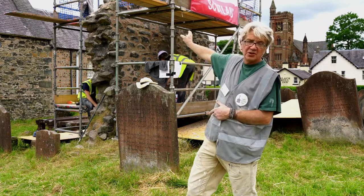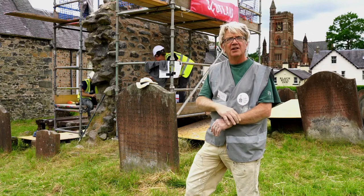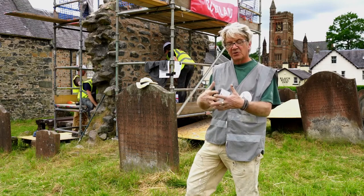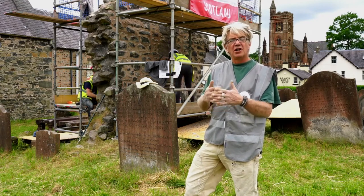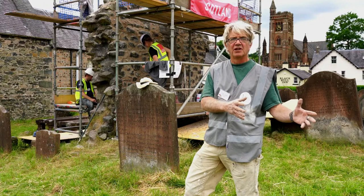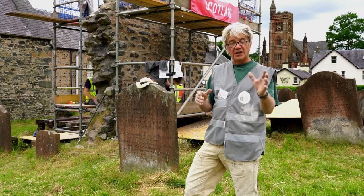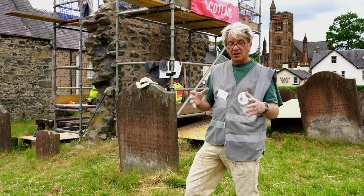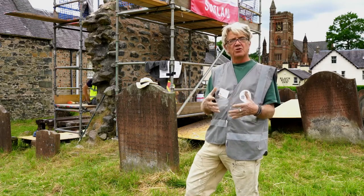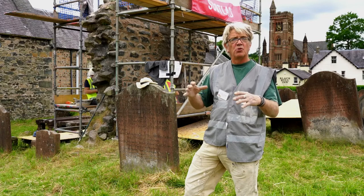So on the top, you can see, if you look carefully, at the moment the top mortars are looking very red, and that's because we've put a pozzolanic brick aggregate in there, brick dust I should say, to react with the lime and to create a hydraulic lime. But a hydraulic lime that I would argue is very different in its nature and character than a natural hydraulic lime. And again, you can make very pozzolanic, very hydraulic mortars by the hot mix method with free lime, with a lot of quicklime, and they retain that workability and that water retentivity in the earlier period of their set. Therefore they too make a very good bond because of that water retentivity.